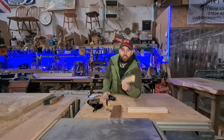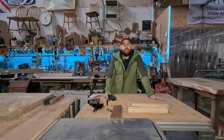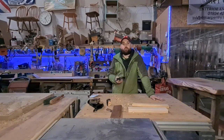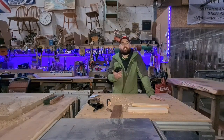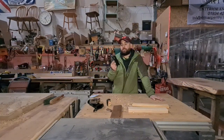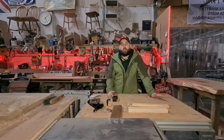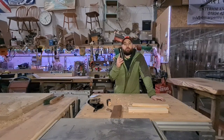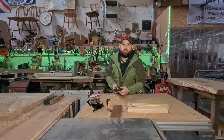It's another versatile piece of kit in your second fix carpentry bag, and for not a lot of money you've got six tools in one. If you haven't got power on site, or you're doing finishing carpentry and your router bit's blunt or something, it's your go-to planer. You can achieve the same sort of edge with a block plane but it won't be round — this takes the ball nose edge off.